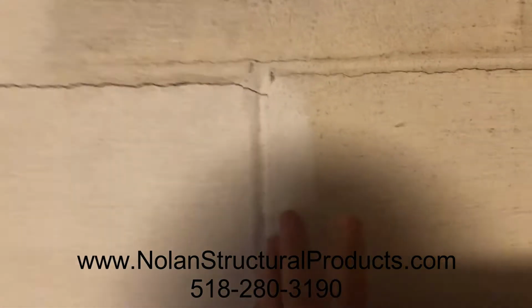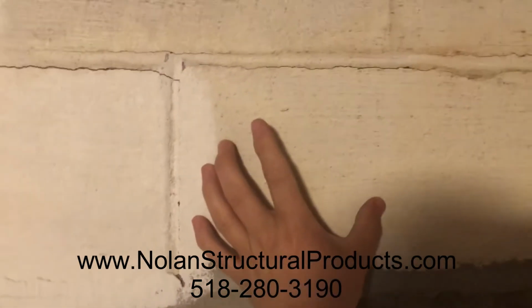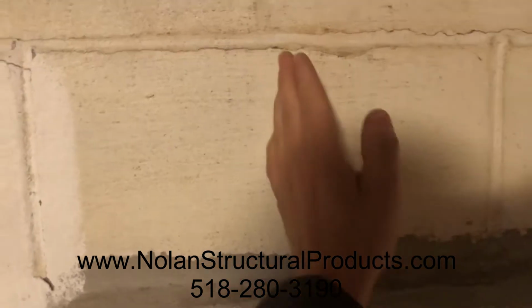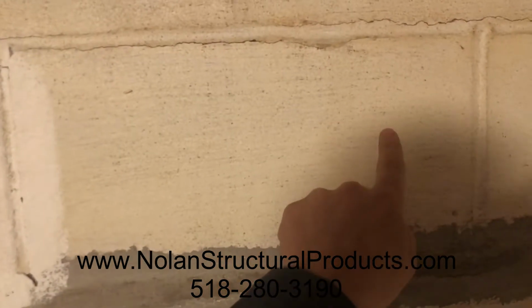Good. The other thing where we put the straps is you want to be in the hollow portion of the block. So this side of the block's hollow, this side of the block's hollow. There's a web stiffener here, so we want to be either here or here.